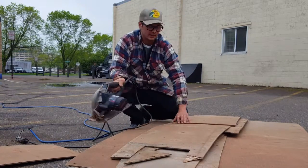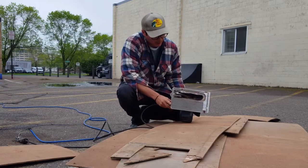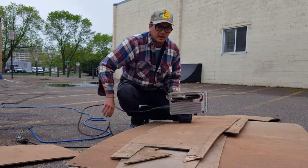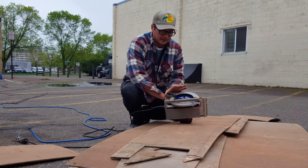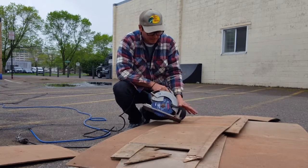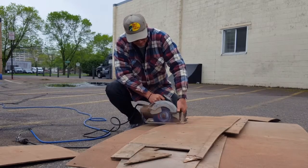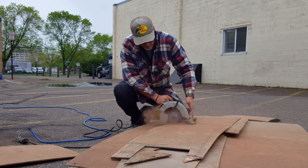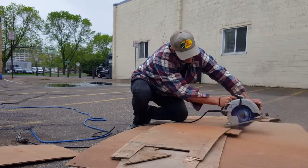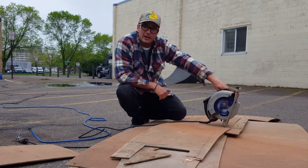To expedite this process, I'm going to dive it down a little bit deeper. I'm going to open her up and freehand it. The depth is about an inch, inch and a quarter. I'm going to try to cut a couple of sheets at the same time using the guard — use my thumb handle to lift it up. That's about it right there.